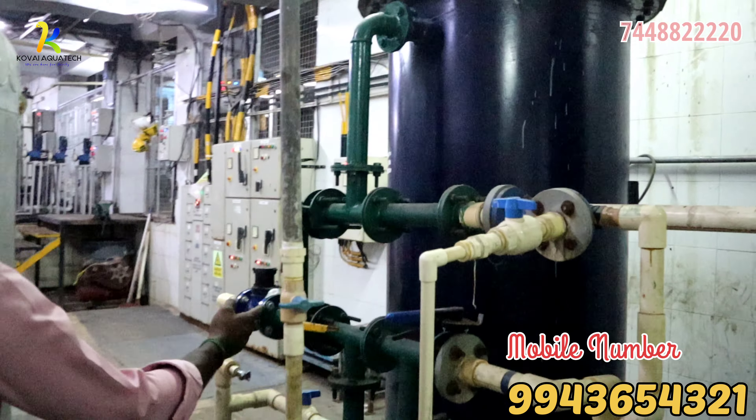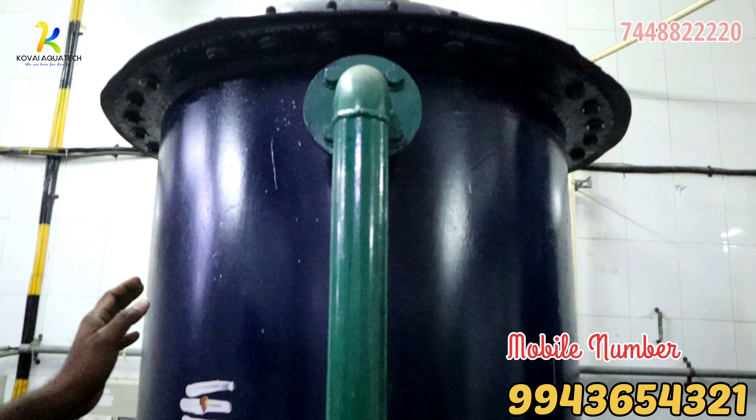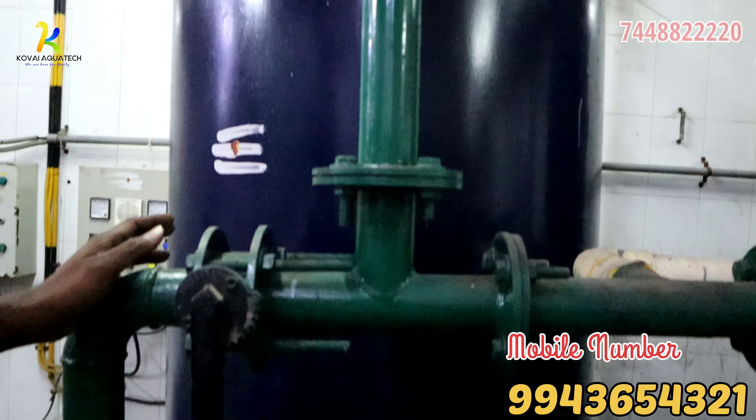Then we put the water to the plant and add resin in the water. The incoming water is about 500 ppm. After treatment we get it down to around 50 ppm or even 10 ppm. This is to prevent scaling.